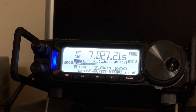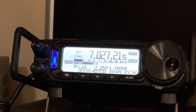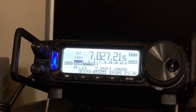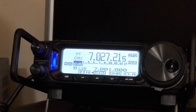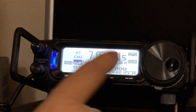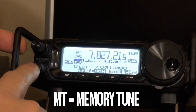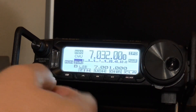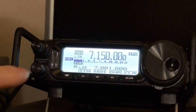Okay, so now that we've got that covered let me get into the meat of the video. Sometimes people say well I'm not getting any transmit on my radio — people can't hear me. So I'm going to switch over to a dummy load. And now I'm going to get out of CW because I've just got the hand mic hooked up — I don't have a morse paddle or anything hooked up. So I'm going to go into memory mode, which I do by tapping my multi knob. That means memory tune. I'm going to tap it until it's on MT again, then rotate my multi knob and I'm back in memory mode. So here is a sideband frequency. Watch the LED when I transmit.